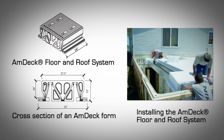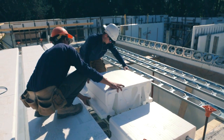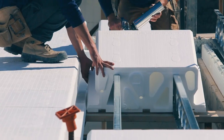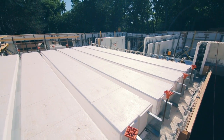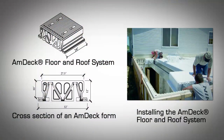The AMVIC floor and roof system consists of modular expanded polystyrene forms. When installed, the EPS forms provide a stay-in-place formwork to construct one-way concrete pan joist floors or roofs. The system utilizes 10-inch deep light gauge steel framing studs to carry temporary construction loads until concrete has been poured and gained adequate strength. The light gauge steel joists also act as furring strips to attach ceiling interior finish such as sheetrock. Please refer to the separate technical manual for installation guidelines and engineering details.